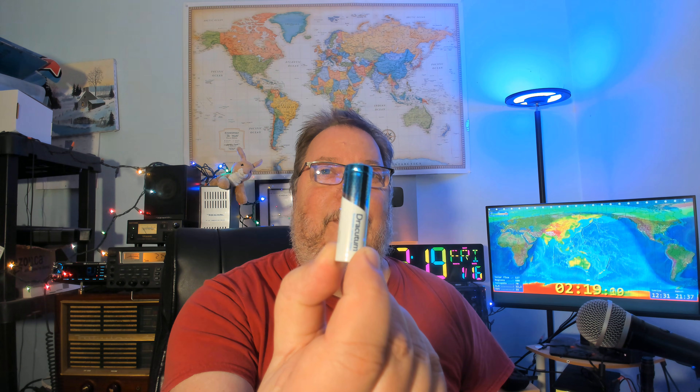The batteries are kind of cute — I like what batteries look like. These are the Dracutum double-As, and they are lithium-ion batteries, which means they need a little circuit inside to regulate, because lithium-ion batteries are 3.7 volts. That's the chemistry of lithium-ion. They have a regulating circuit built-in that drops the voltage to 1.5 volts.